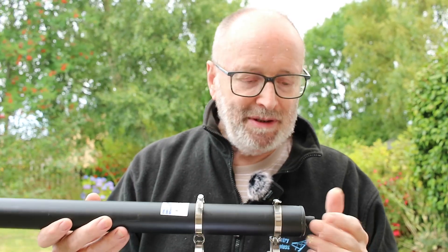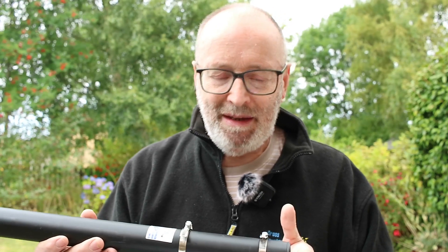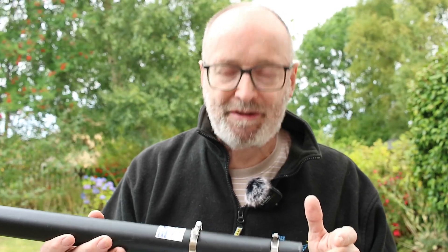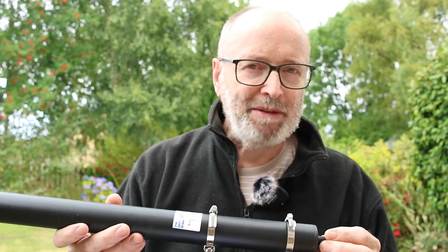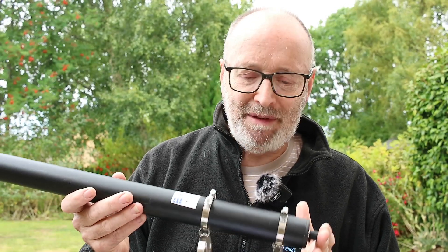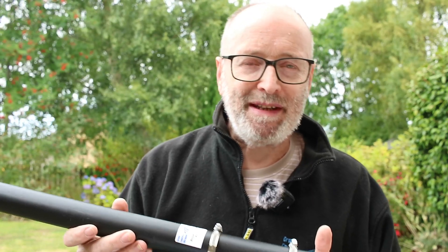Typically you feed the power up the coax from a bias T. It will take from 4.5 volts to 15 volts, with a typical current of about 40 mA through the antenna. It's ideal for use with an SDR Play antenna — the bias T on Antenna B works very well with that and covers all the frequencies you need from high UHF down to long wave.